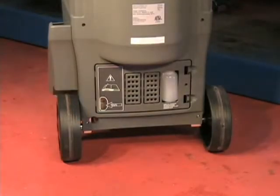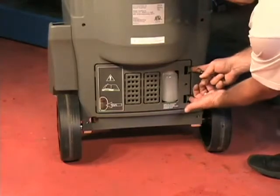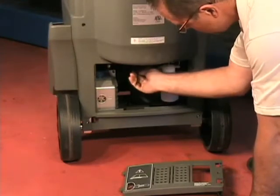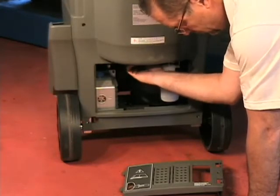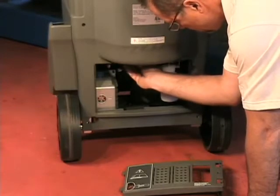To set up your new CCST-288, start by backing out the scale travel pin. Remove the lower back cover and find the 10mm locking nut to the left and behind the oil discharge bottle. Use a 10mm wrench to unlock the nut and then back the 10mm bolt out about 5-6 full turns.